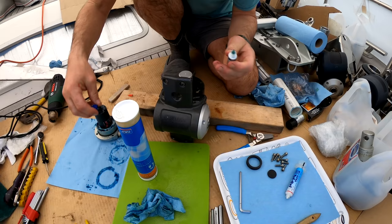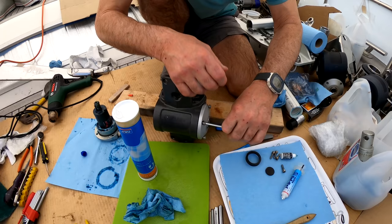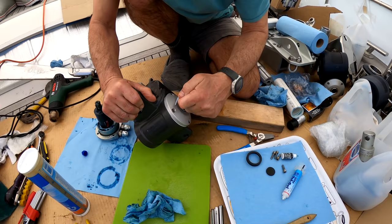Then drop the old blue Loctite on, because I don't want these coming undone. And if you've got something round like this, you should always just do the bolts up sequentially. Now we're getting Tef-Gel coming out, so we know that's got a good sealant around there.